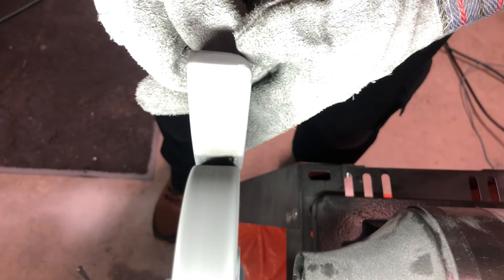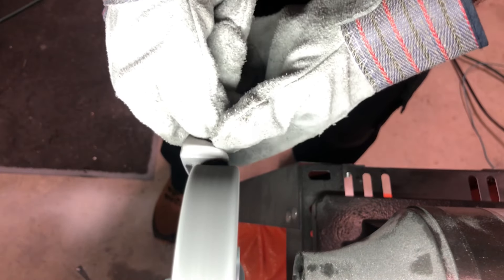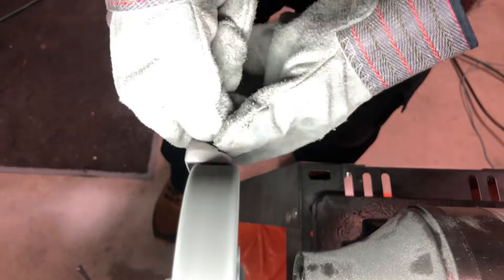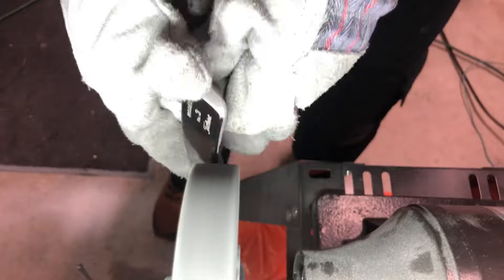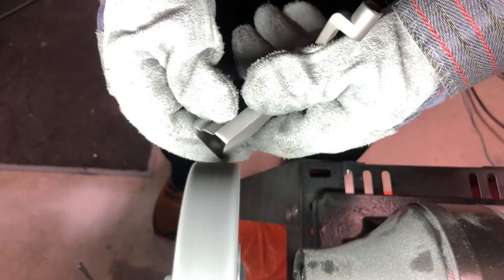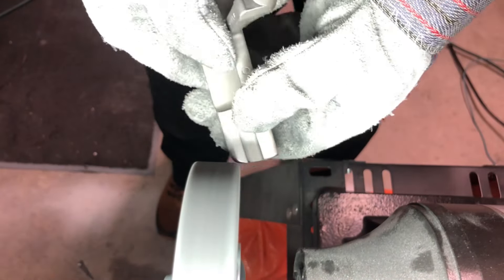All right, so here we're on the buffing machine. I'm using a medium grit deburring wheel, and what that's designed to do is just basically blend out any dings on the surface of this putter. The putter wasn't in too bad a shape — it was mostly the sole that had a lot of dings, which is very typical. We just went through the corners, all the little angles, and took out any dings or dents along there.